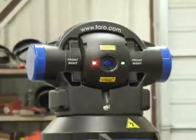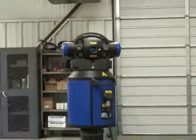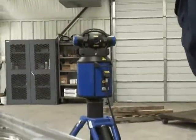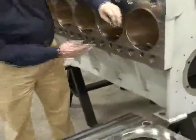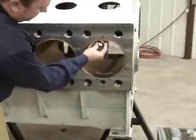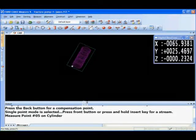The frack pump can be oriented in any position — it does not have to be flat or level. It can actually be sitting inside of a machine. You can take the portable laser tracker CMM to the part and inspect the part before it comes off the machine. This is critical especially if you're boring a large cylinder — you can determine if that cylinder is concentric and perpendicular to the features without removing it from the machine.